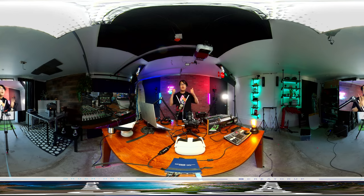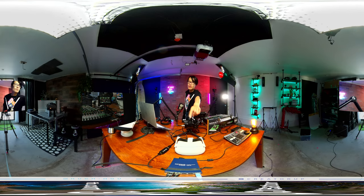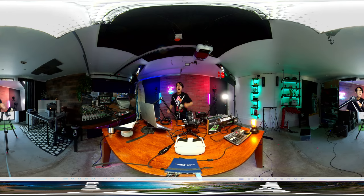Also make sure there's no latency when you're running all cable, because the router provides Wi-Fi, but most of the time I don't use Wi-Fi. You look down right here, the Netgear right there, hardwired in gigabit Ethernet. Some of the cameras can also provide PoE, called power over Ethernet, so it powers your camera. But my suggestion is always go with a cable if you can: HDMI, Cat6, fiber optic, whatever you use.